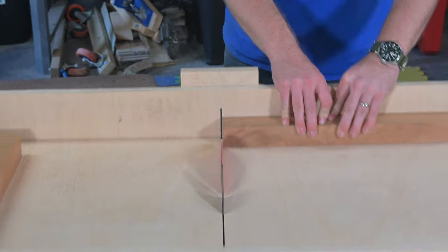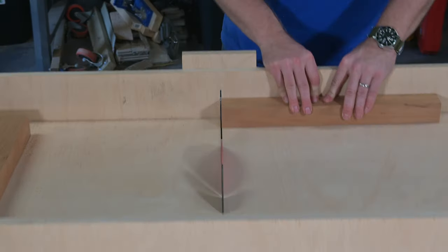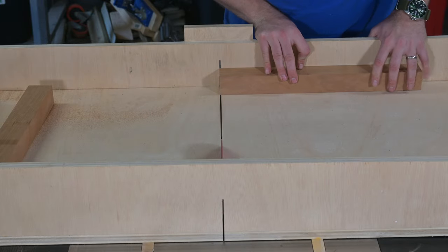After getting all my lumber milled and cutting the table legs to the correct thickness and width, I use my crosscut sled to ensure that one end is perfectly squared. I then use a stop block clamped to the sled to cut the other end of each to ensure both square and equal length for all four legs.